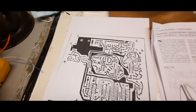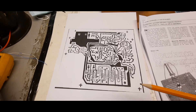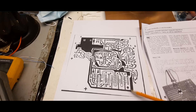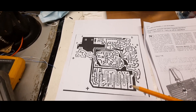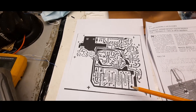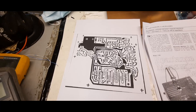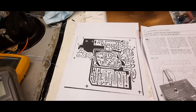It's quite an involved one — here's the PC board. I use the toner transfer method. This isn't the actual copy, but I'll print it out on a different piece of paper which I can do the toner transfer with. I'll have the soldering on one side and the components on the other side.